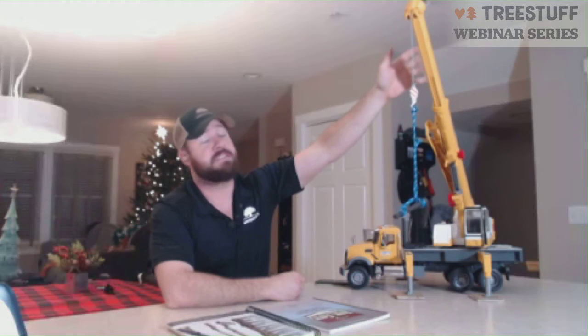This is very important in tree work because a lot of times we're cutting and rigging things from a tree. If we're not making sure that our loads and all of our picks are very stable, you run a much greater risk of dynamically loading the crane and how the piece comes under tension on the wire. I've sadly seen some people doing crane work who have used felling notches and have felled tree stems into the load line and shocked the whole crane. You hear the wire slapping the top of the boom, and very bad things are occurring. This is dynamic loading the crane. The effective weight being felt is much higher than the actual weight, and you'll exceed the capacities in your chart, creating a structural failure or a tipping and stability failure.